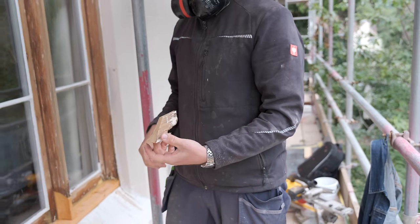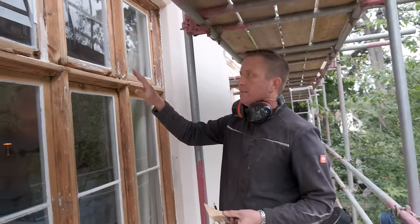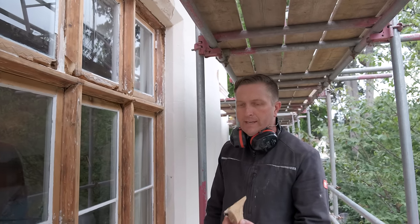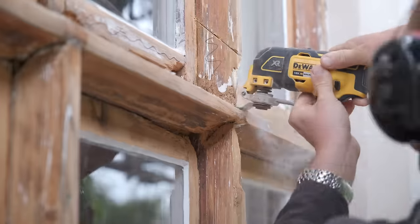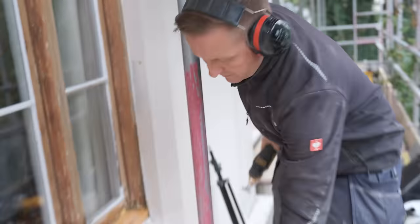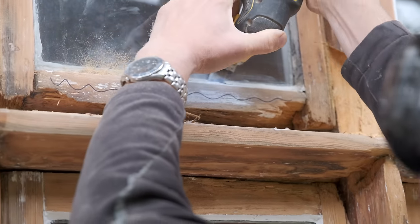I'll lay everything out in order on the scaffold and slowly go through and cut out these new pieces to go in and get them resined in. This will all get treated with the two-part liquid, and then when I put the new piece in it'll all have the resin buttered up so when it gets pushed in all these pieces get filled. I'll dig this filler out as much as I can below the surface so I can get some resin on top to clear it. These windows are that bad I can't dig 100% out — this is original glass in a lot of places. It can be replaced but at very huge expense, so there's just no need.